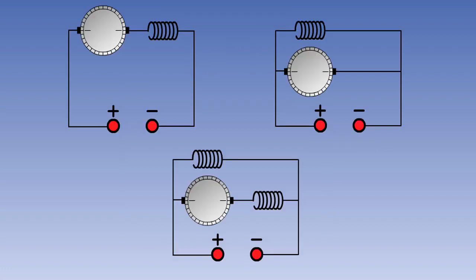The stationary field of a DC motor is produced electromagnetically, so that by varying the current flow through the field windings, we can vary the strength of the magnetic field produced. There are three types of DC motor in common use, and they are categorized according to the arrangement of their field windings. The three types are known as series wound, shunt wound, and compound wound.